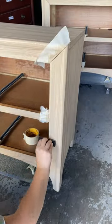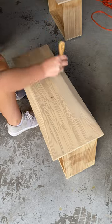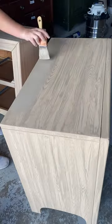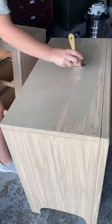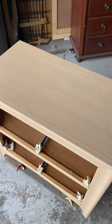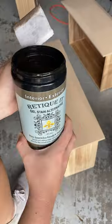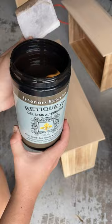This step is going to look like crazy tiger stripes, but don't worry because once you go over it with another layer of the pickled oak stain, it's going to start coming together. This layer on top is going to make it look really subtle and natural. You can stop here and topcoat it, but I decided that I wanted to warm it up a little bit with this pecan gel stain.